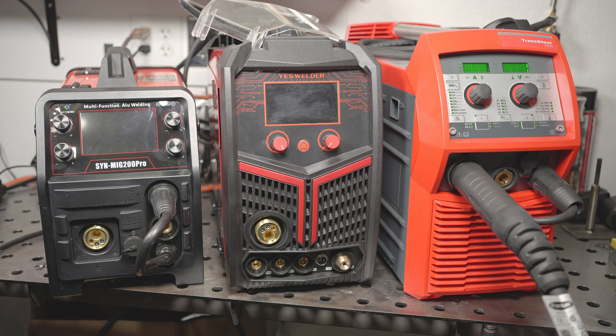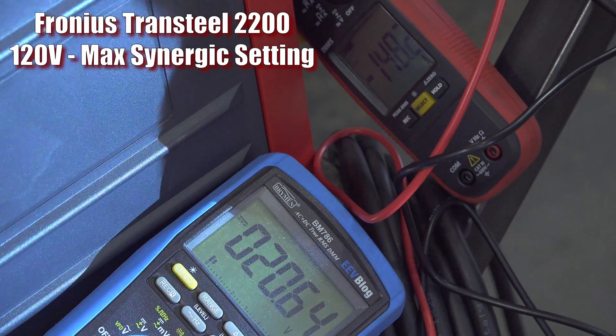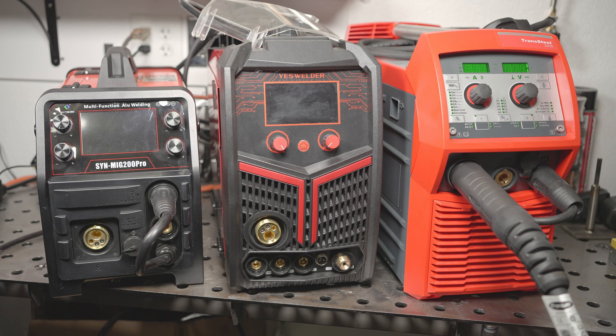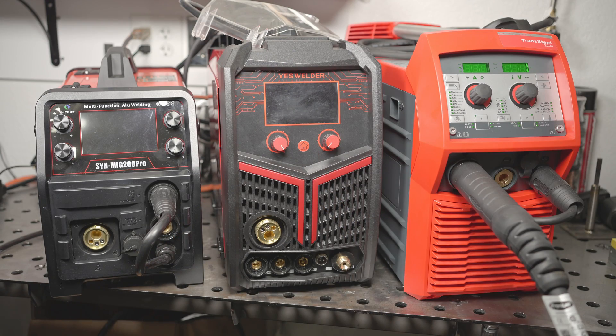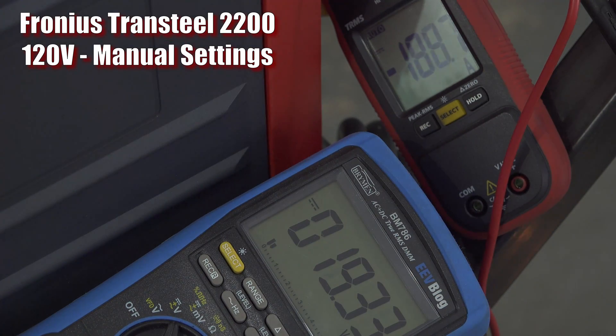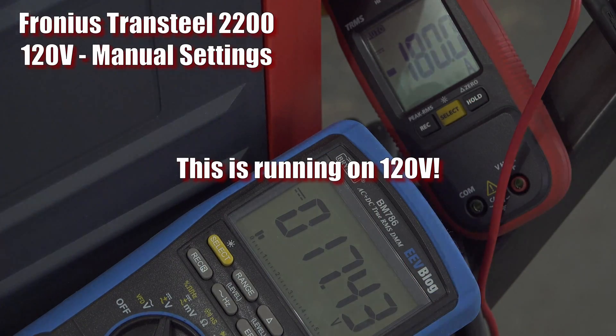Moving on to the Fronius, it seems to have a soft limit of a little over 3,000 watts of output when running on 120 volts. I imagine this is to limit the draw from the circuit when running on typical 120 volt circuits so that they can meet various safety and regulatory standards. However, it doesn't seem to have a specific limit on amperage or voltage, just the total output wattage. So if the combination of voltage and wire feed speed results in much over 3,000 watts of output, it automatically backs off those settings. So if I set the voltage to around 19 volts, I can get over 160 amps out of it running nice and smooth. And if I turn the voltage down to around 17 volts, I can get the amperage to peak at over 200 amps, averaging right around 180, which is pretty surprising on a 120 volt supply.